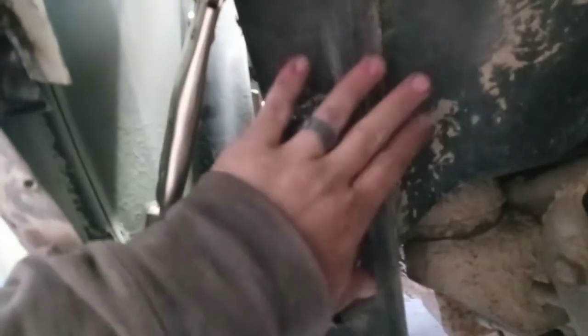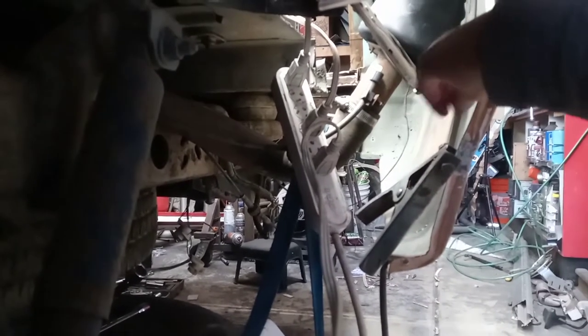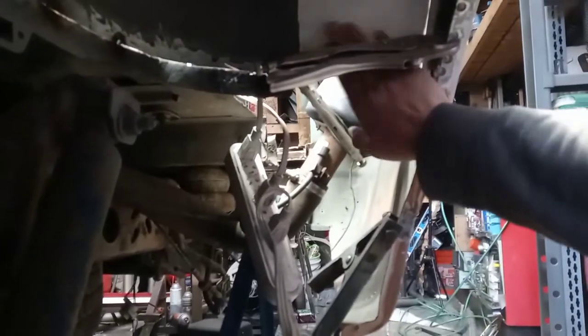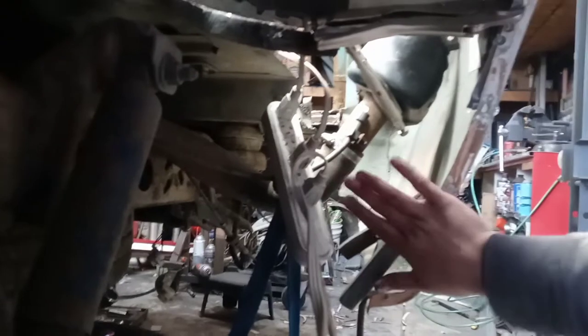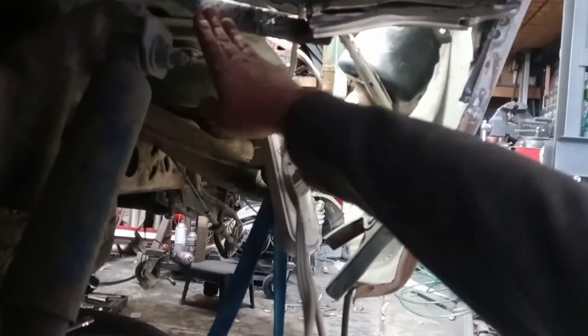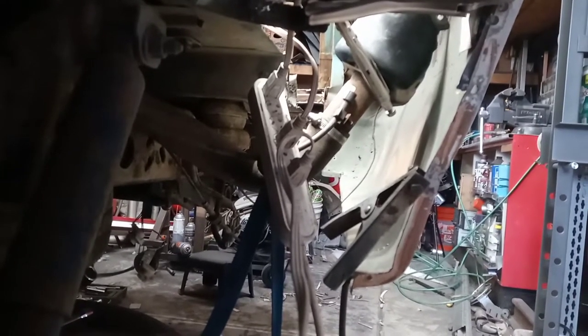And I think what I'm going to do is extend the inner wheel well lip. So I have an inner wheel well lip all the way down and then extend that backward so I can just bring this down and just basically a flat plate that goes from this edge of Tahoe right here all the way over and will connect to the inner wheel well just like this does. And same thing on this side. I'll have to build a lip that will go down behind all of this and then it will extend backward so that I can connect from this and just come straight down to build in a panel to block off the interior of the body. That panel will probably come around back here some just to create a nice blocked area, protecting a lot of that crap from just junk getting thrown back in there.